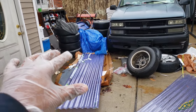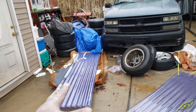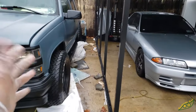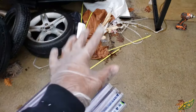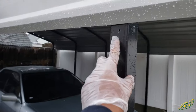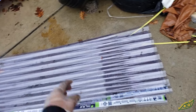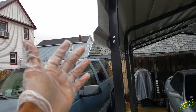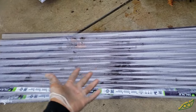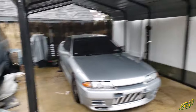I'm going to start installing the siding. Assuming you're by yourself and trying to do this, the easiest thing to do is pre-drill the hole. I measure it out and pre-drill the hole on each beam. Then all I have to do is hold the siding up with one hand, use the gun, and it'll bore through very easily. If you've got a material that's much thicker, like sheet metal, you're going to want to pre-drill those holes too. This material is very thin so I can just bore through it quickly and easily. I'm going to set up the time-lapse camera and let's get these things installed.